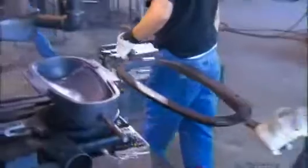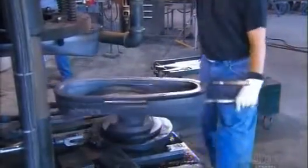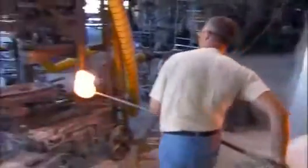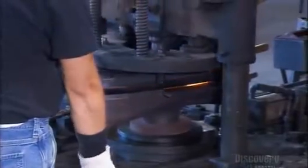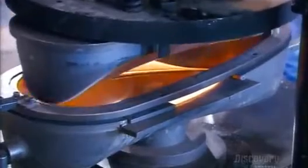Next, it's on to the molding process. Workers heat a ring and transfer it to the top of a mold. Then they twist and turn a stick called a punty to gather some melted glass and carefully string it in the mold. A plunger squeezes the molten gob into shape. The glass solidifies in seconds.